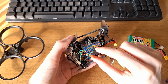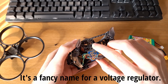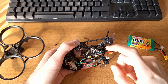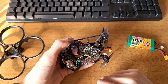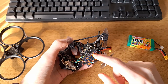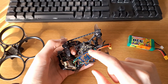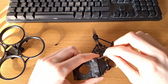This drone's flight controller has a 5V BEC, but it's just not powerful enough to provide reliable current for both the wifi module and the camera. You can also get additional noise which would make the signal worse. So it's recommended to have an additional external BEC connected from the battery terminals to the camera and the wifi module. I'll also show you how the camera is connected.